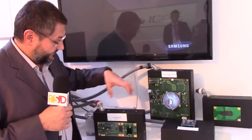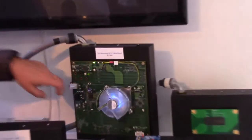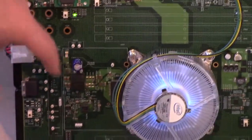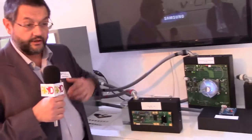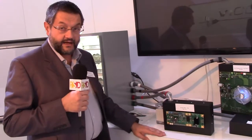Here again we have a combination of a PRM and VTM. You see the PRM hidden here — it's a system-in-package PRM, a smaller-size PRM that feeds a VTM, which is this one hidden here. The VTM is the real voltage transformation module that operates at high efficiency and steps from 48 volt down to 1 volt directly into the core logic of the processor. This approach beats the standard VRM solution which is on the market.